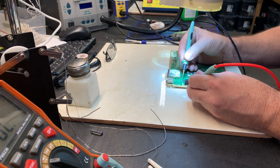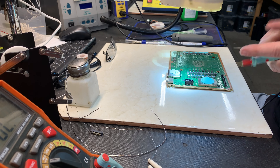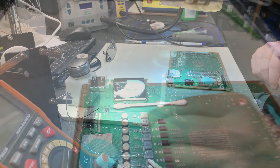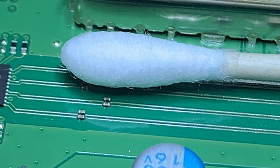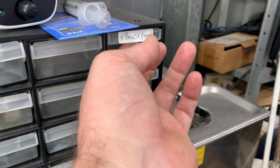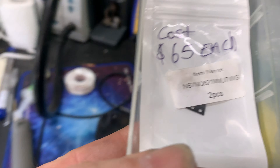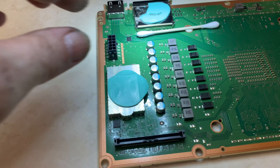I don't think I've got any encoder IC in stock. After about 20 minutes of poking and prodding I've come to two conclusions. That chip there — there's a Q-tip there for size comparison — that chip is an HDMI encoder IC. So we are going to try that. It costs $65 each, which is crazy. We've got a couple more, so we're going to try that first. I honestly don't think it is that, but it is the easier thing to try.